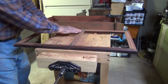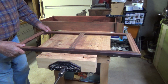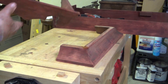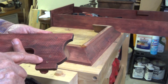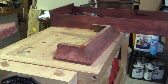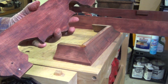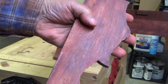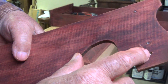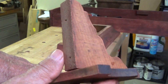All we've got to do is clean this — finish cleaning this. Okay, we got these two pieces put back together now. Glued. There were two nails that went in here — there was some warp in here, so I put a brass wood screw in there to try to keep that warp from getting any worse. Same here — put brass wood screws here and here. One here, one here — I may put another one in here just to keep that from warping.